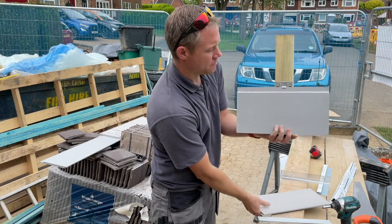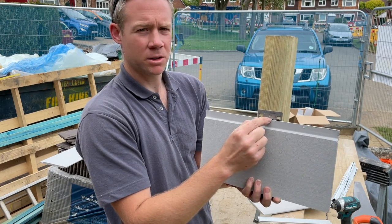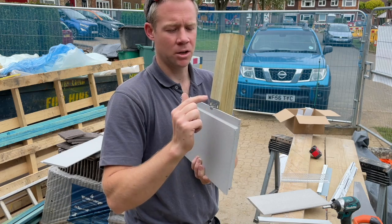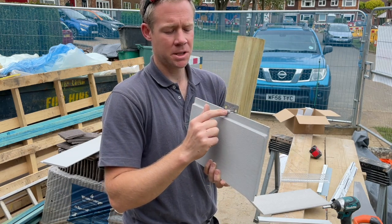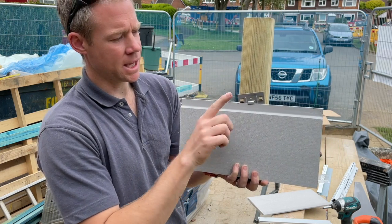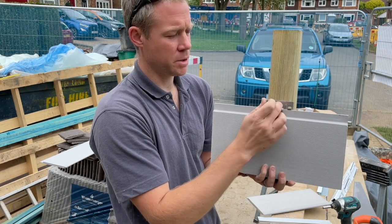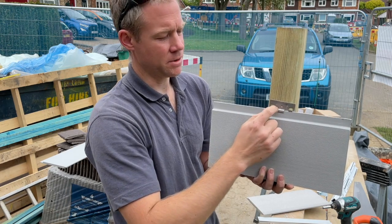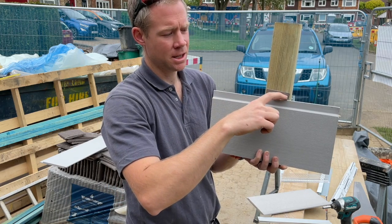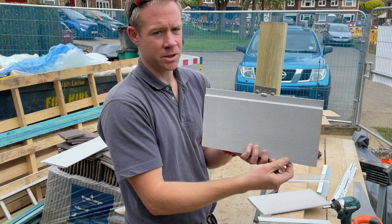Now, a couple of comments. These clips, whilst very good, can be a little bit of a pickle to fit on properly. The top dimension of this seems to change a little bit. Might be because of manufacturing or paint or something. Also might be a slight tolerance thing in the clips. But it's quite important to get them on and make sure they sit properly, because sometimes that's very exaggerated, but they can sit and kick like that. Especially when you screw them in, because of the torque of the screw pinching up against the bracket, sometimes it can twist it ever so slightly and kick it up. Might not seem like an awful lot, but over a long length, if you've got that in the middle, it'll make it rock, and it means that these little lugs then won't locate on the board above, and that'll be flapping around. So that little lug fixes the bottom in, and that's quite important.